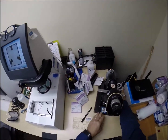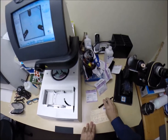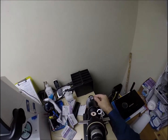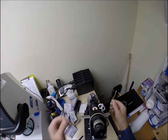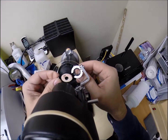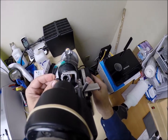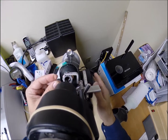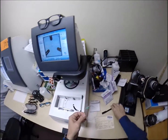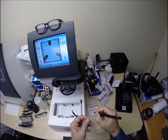Let's do the same thing now for the left lens, which reads plano minus 1.25 at 180. Plano minus 1.25 at 180 — we only have to turn it 5 degrees to get there. Put the power drum on plano, which is zero. Rotate the lens until the spherical component comes in clearly. Check your astigmatism correction, which is all you get in this lens since you don't need any power correction. And then put the three dots on your lenses. And that is the left lens.